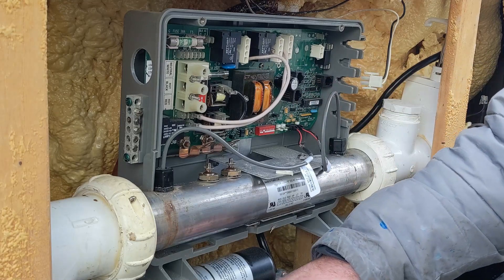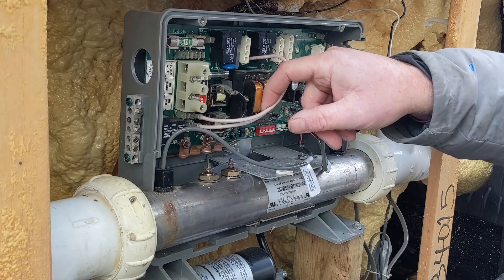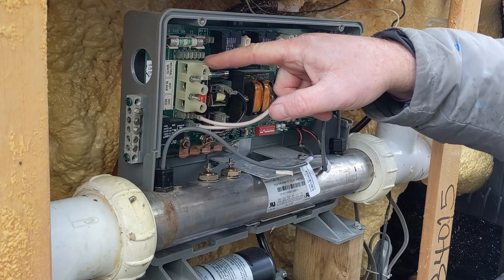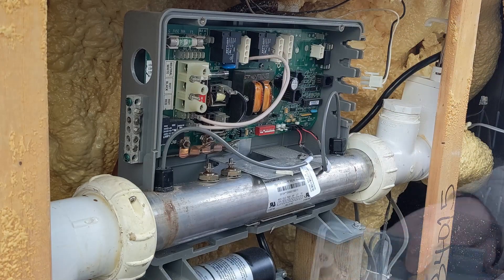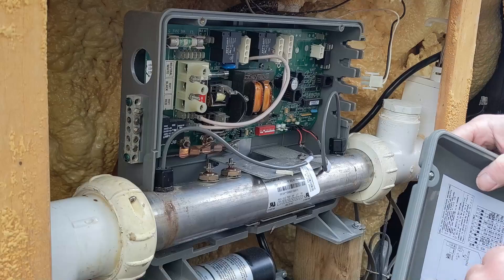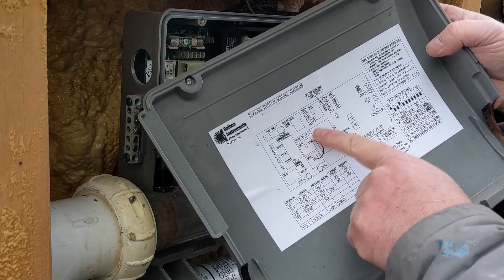You have to look at the sticker on the pump, on the ozonator, everything else. You change all the wires on the new VS to 240. If it's 120 volt, keep it up here. All the information is right on the back of the board, even the new one. If you're not sure, look at the back of the board — the schematics are there, just follow along.